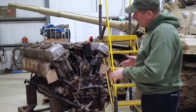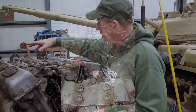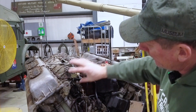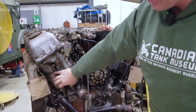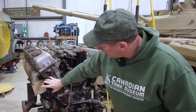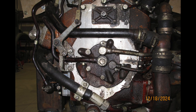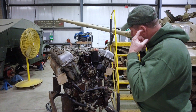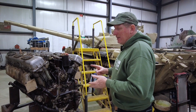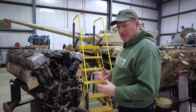Now this engine is in several pieces. A lot of the stuff in the center here is all related to fuel — your fuel filters, your injection pump, all your fuel supply and return lines are on the top. Both your exhaust and intake cams are in each cylinder head. You've also got the cylinders themselves as a block assembly, so it's all components put back together. You've got a head section with the inspection covers and valve covers, then the block section that has the piston inside it. You have an upper crankcase section and a lower crankcase section which comprises the oil sump — what we would call the oil pan. It's just a bigger unit but very complicated, with a lot of moving parts. There are coolant lines, oil lines, oil lines that supply the lower crankcase half, and coolant supplies to the upper crankcase half. It's just very, very complicated.